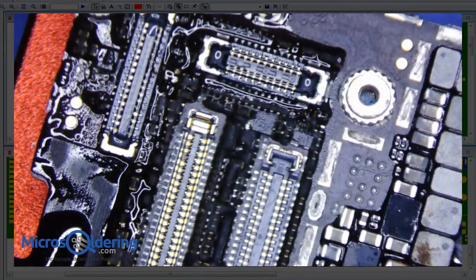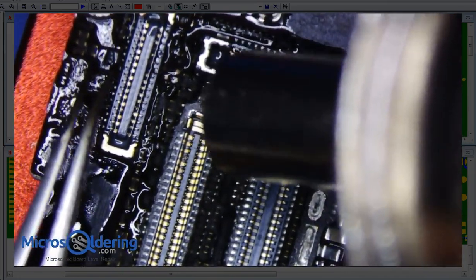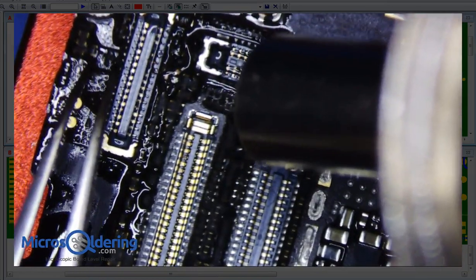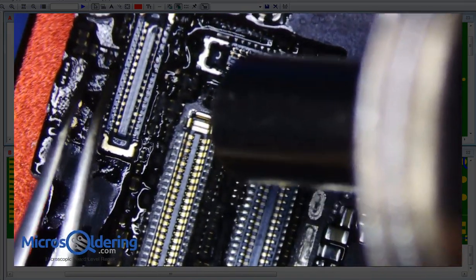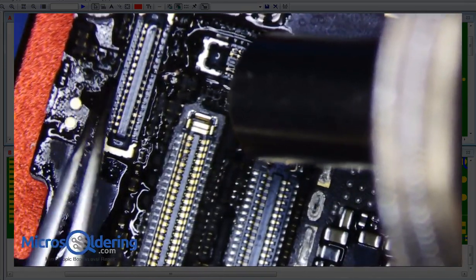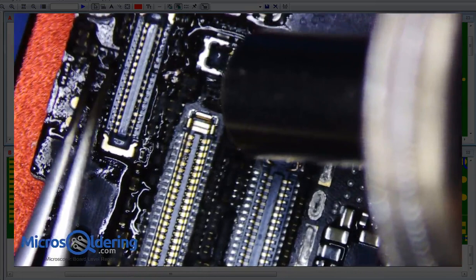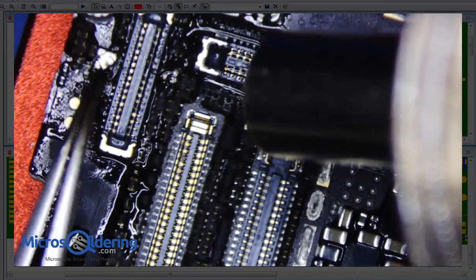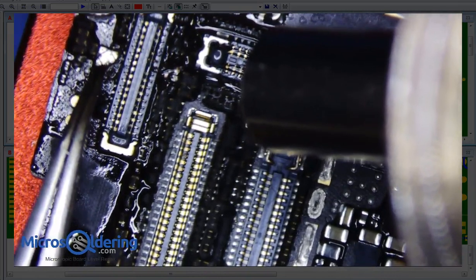I think when you're doing data recovery, you have to give up on the fact that you're going to get this phone to work. There are certain instances where you could say, let's see if we can get the phone to work in addition to recovering the data, and the customer will be especially happy. But in this instance, it may be possible, but you're probably looking at doubling or tripling the time it's going to take to get the data off if you go in with the mindset that you're going to fix it. So I would say just don't even bother.